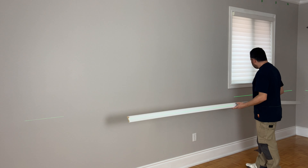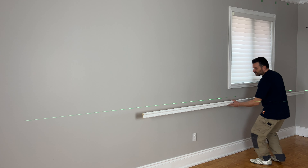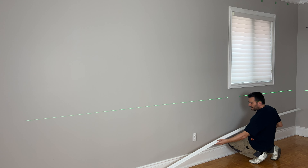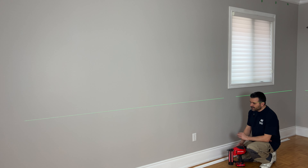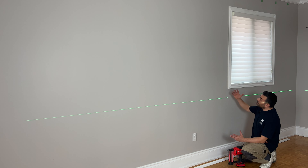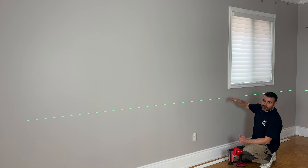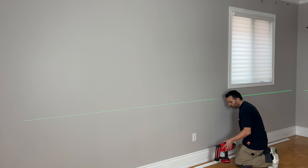We're ready to go with our first piece. One end is going to butt right against the wall, the other end is a scarf joint. We're going to line this up so that the top is right in line with our laser line — or with your pencil marks, whatever you used to mark your wall — and just nail it in. One quick note: you might be asking how you decide how high up the wall to put your chair rail. Typically the rule of thumb is you want to be one third the height of your wall. My wall is nine feet tall, so easy calculation — I want the top of my chair rail to be at the 36-inch mark. It's as simple as that.